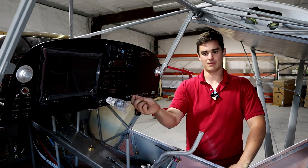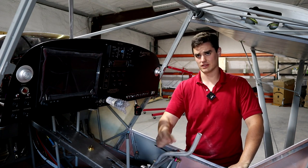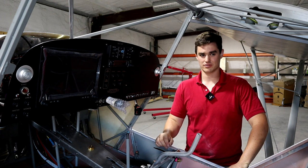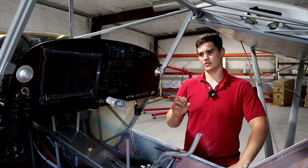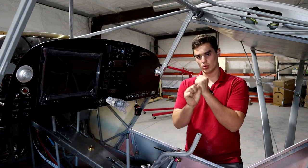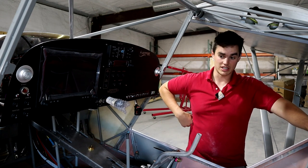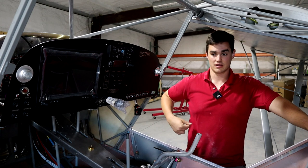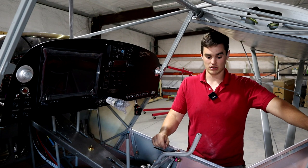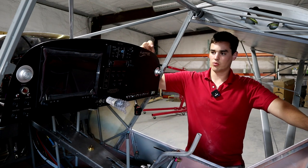I do have one short I'm chasing in my tail light wiring — something to do with the ground on the shielding. I soldered it myself and didn't do a very good job. I found these solder terminals from Stein Air that you hit with a heat gun and they pull down with solder on the shielded wire. I'm going to chop those connections and redo my work on the rudder light and see if that solves the problem.